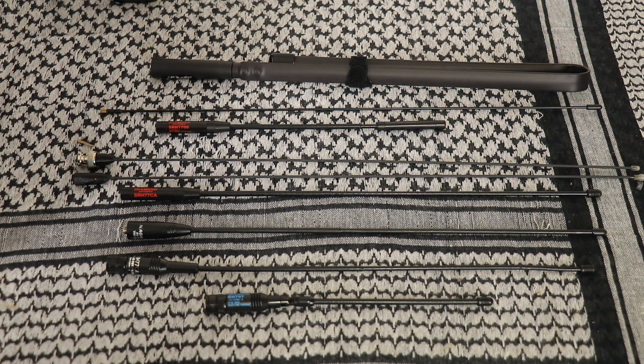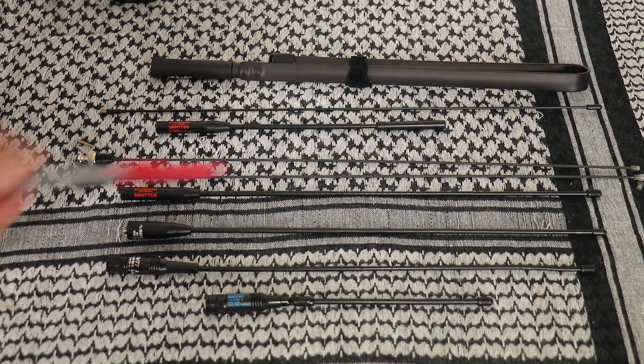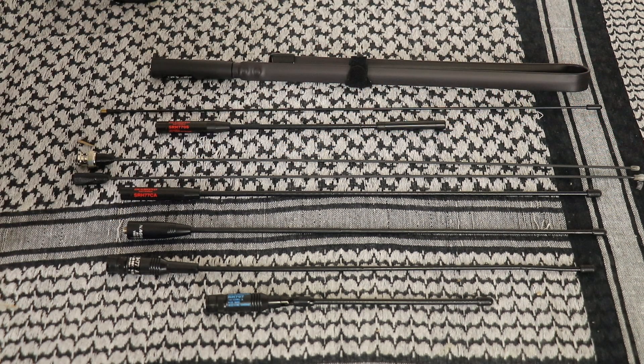The next one is a Diamond antenna — really good for backpacking. It's 70 centimeters long, weighs 45 grams, a 2 meter/440 antenna that comes in two pieces. The website claims a gain of 2.15 dBi on 2 meters and 4.5 dBi on 70 centimeters. The next two have become my favorite antennas — they're made by Signal Stuff. The top one is BNC and the bottom is SMA male; you can also get SMA female. They come in assorted colors, including a glow-in-the-dark option. Depending on how you order, they run between $20 and $26.50.